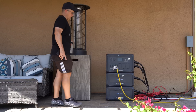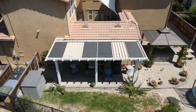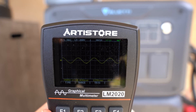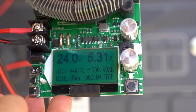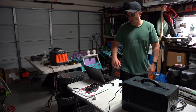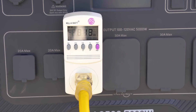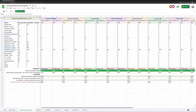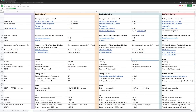I've had the unit for three weeks now, powering the AC and computer in my office on a daily basis. It's hooked up to 1,600 watts of solar panels on my patio's roof. I tested the inverter's efficiency for AC and DC along with a pure sine wave test — it did return a pure sine wave, which was no surprise. For DC efficiency testing at 24 volts, I got about 77% efficiency, and for AC efficiency I get 82%. Compared to the smaller solar generators I've tested, these numbers are on the low side, as it's a larger inverter and draws a lot just to power itself. I'll put the test results along with the specs in my solar generator buyer's guide spreadsheet so you can see how it stacks up.